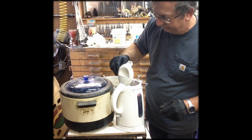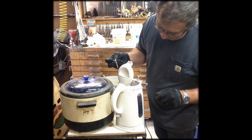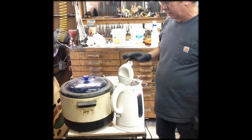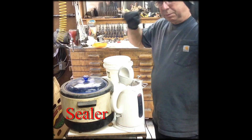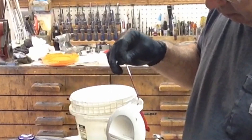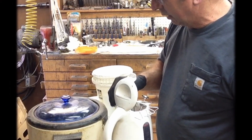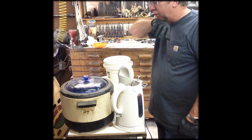Pretty red going on there. Looks like that's all going to take really well. We'll let that set and cook for about another 10 minutes. I'm going to go ahead, clean up my acid tank, get the lid back on it, and the sealer's heating up. Our sealer's just almost to a boil here, and what I can see so far — our red looks really nice. I'm really happy with that. Let's give it just a couple more minutes until we actually start to boil. Then we're going to pull these out, rinse them off, and they'll go into the sealer for about 15 minutes.